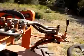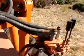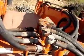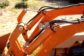From your hydraulic control here, this goes back and services the PTO and the steering. From there you've got this takeoff that comes around and comes up into the control for the loader on this side. Your return line is down here, which goes back to the reservoir. The manifold is in the middle with two control lines each coming down to the pistons.